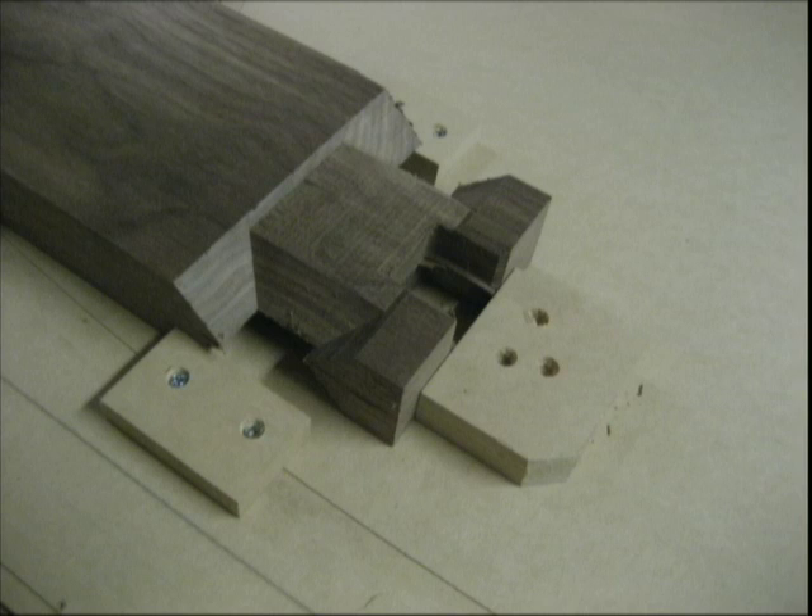Here it is on the machine. It involves double-sided machining — the machine can only cut from one side at a time. To flip it and register it perfectly, you use the tool to cut the jig. Those little blocks of MDF — actually LDF, lightweight, cuts easily — were cut with the machine first. I have the machine scribe a ghost pattern into the spoil board, screw the blocks down so they overlap slightly, run the file again, and it cuts them to perfect size. Cut one side, flip, cut the other — a technique I use all the time.